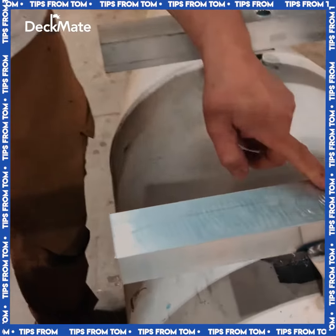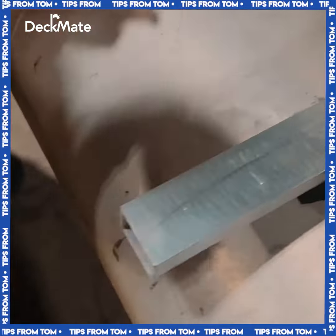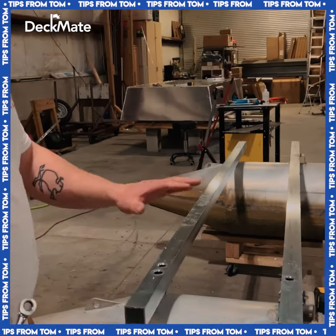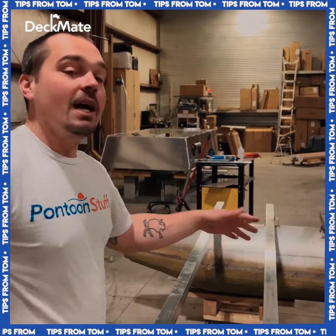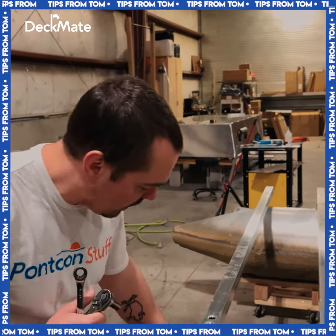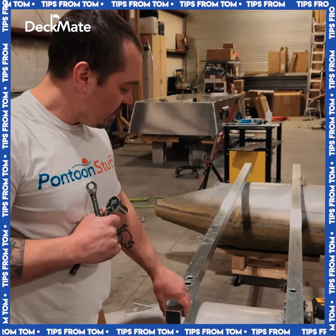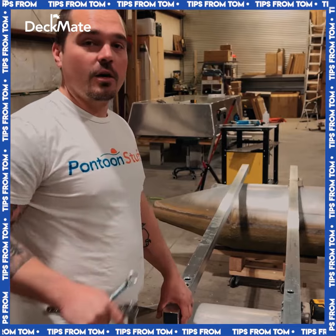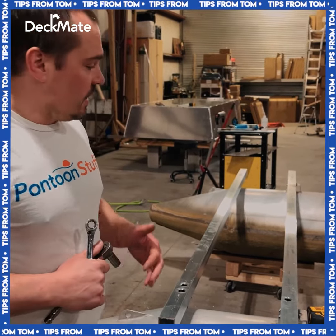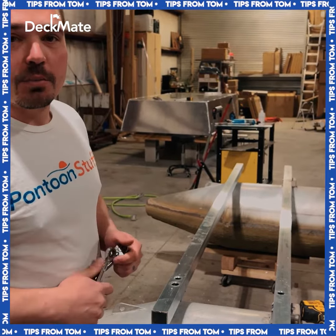Now I've got everything tightened down with that added support of my square tube. I'm going to do the same — this one will get two bolts. If I were working a transom into this, I would do the same thing to integrate the transom in as well. But this way I can use square tubing and still get at my hardware to get those cross members secured in. Remember, use stainless hardware. On this type of thing, I like to use a nylock or locking nut — that way it stays in place forever. Hope this helps on your restoration project.